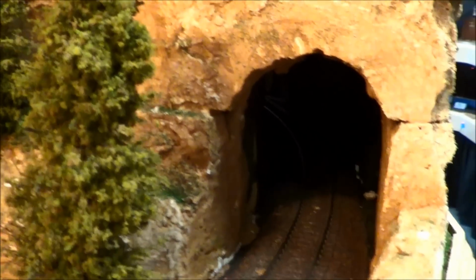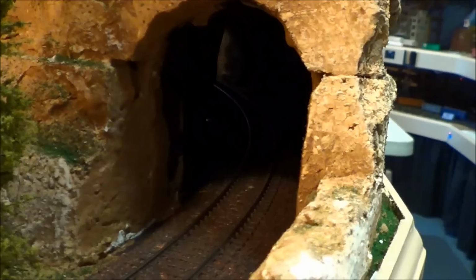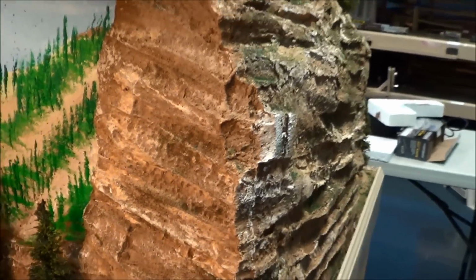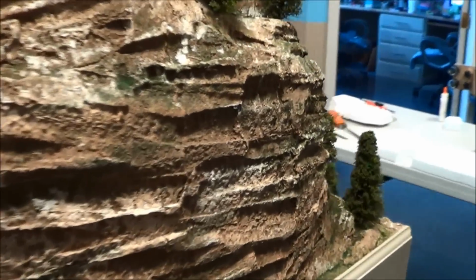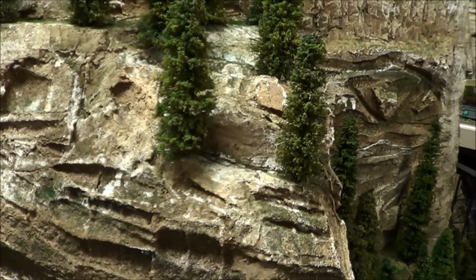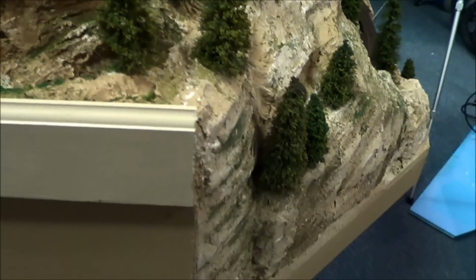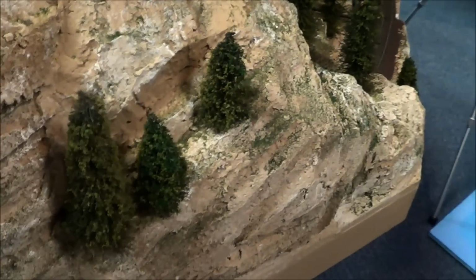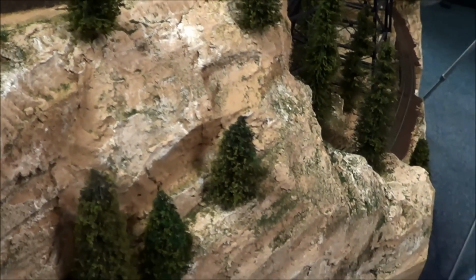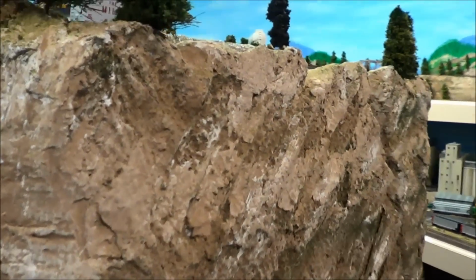Now, the stacked plaster up in there. I usually have one or two little white spots I've got to go catch. Oh, the camera tells all. But everything else in there was painted black, as it was all assembled. Again, a lot of this was just roughed in and put in, and if you watch the videos, you'll see that a lot of it was sticking out. Then we took that hot knife and started carving it off. And then we ran it up sideways, like down in here, turned the blade sideways to create the roughness. This is another example of the blade being used sideways and just melting the Styrofoam back.